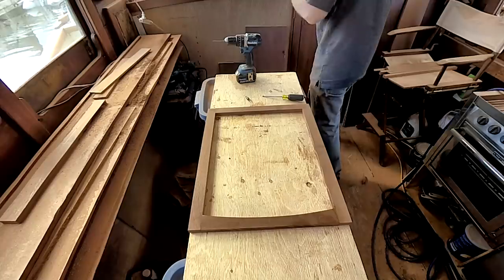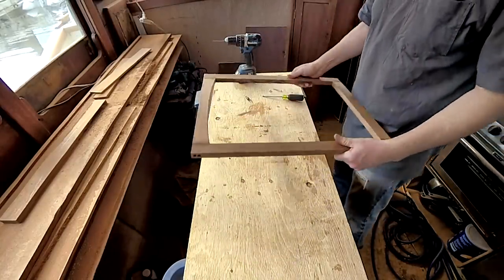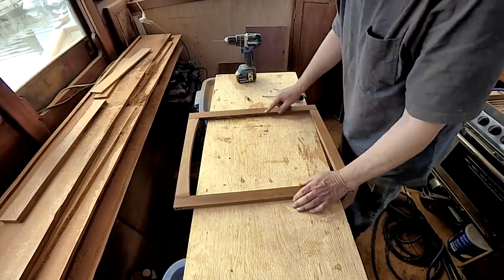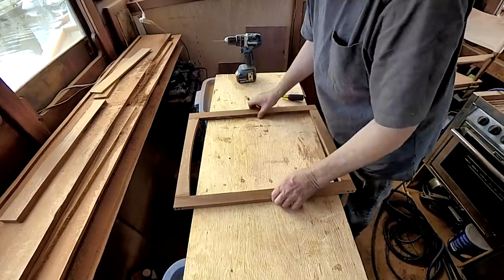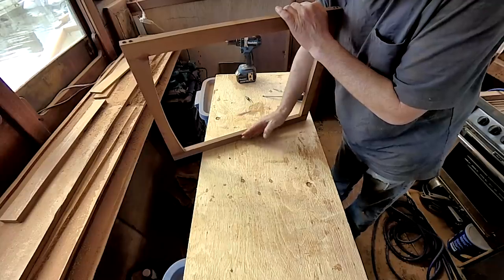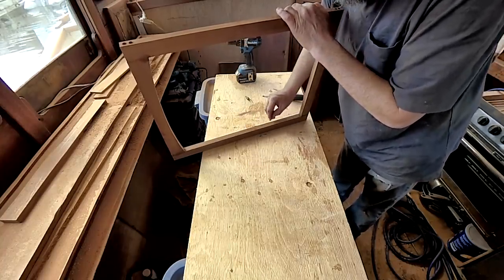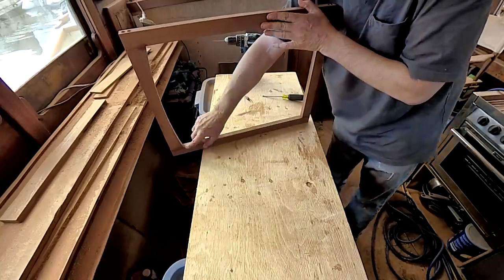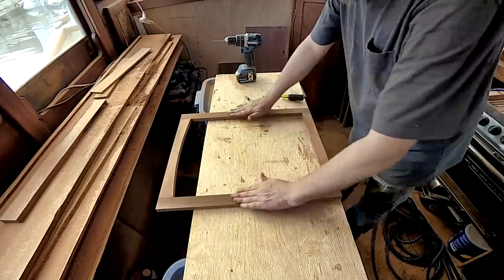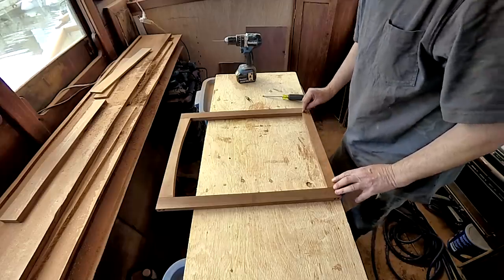And that should be a relatively secure and strong doorway. So now there's a couple steps to be done - I'm going to sand it, make it all pretty, clean up the edges, make sure it fits, make sure it's still square. But more importantly, I have to rabbet out a dado so I can set the glass into it. I'd be rabbeting it out from the back all the way through, leaving maybe a quarter of an inch of wood left so the glass would sit back a quarter inch from the front face. With stained glass, which it will be someday, that gives me a quarter of an inch to put a tiny little bead of wood and some tiny pins to hold the glass in. In the meantime, I'm putting plain glass in because I don't have the opportunity to get any leaded glass made up.